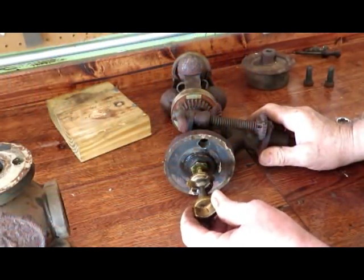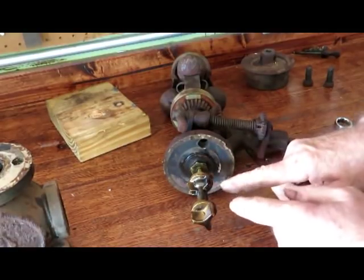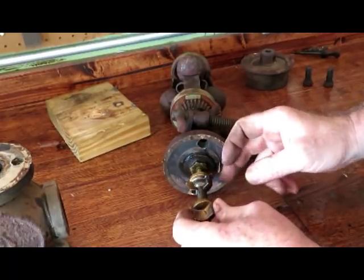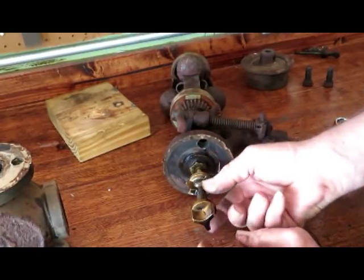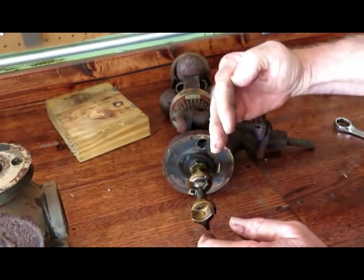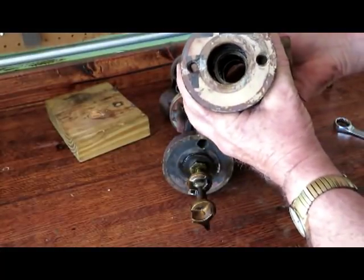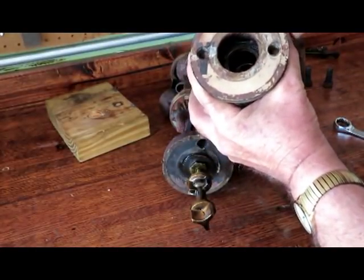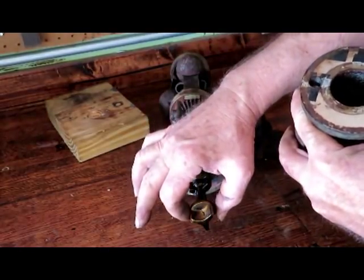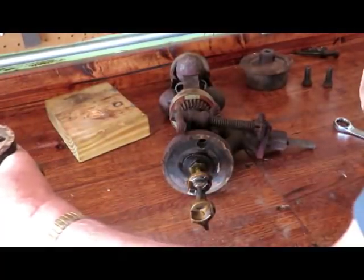This is the valve. It's a double valve. The steam works from the inside out so that there's no real force. It balances and there's no force on the valve when the rod tries to open or close it. It's got two seats down there. They're brass sleeves, and this fits not tight, just a slip fit down in those brass rings.